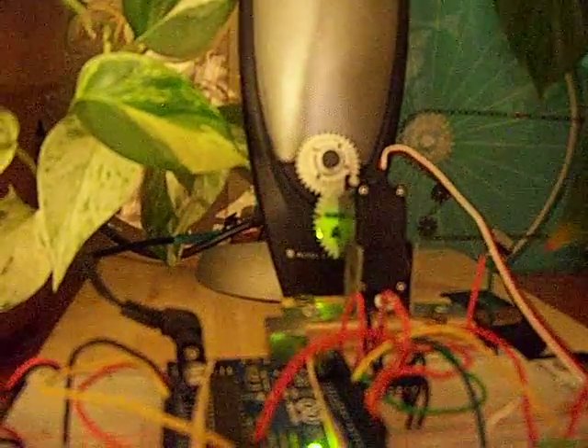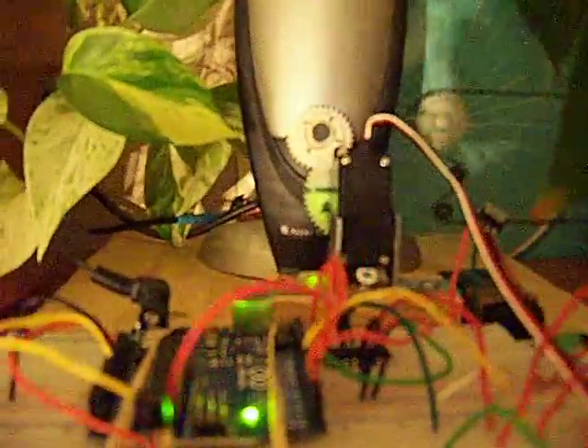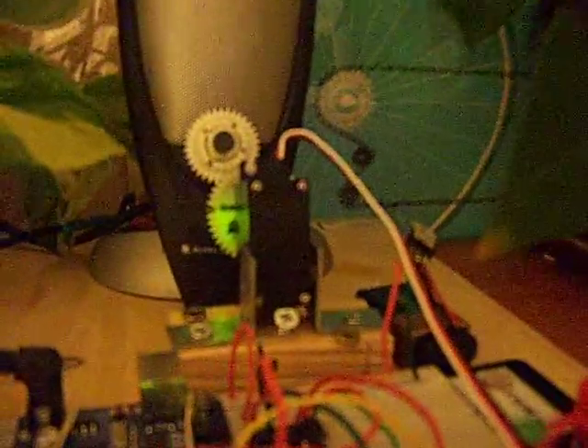I did have trouble. Once I adjusted the servo motor to the volume that I wanted, the servo motor was making a lot of chatter. I tried hooking it up to a MOSFET, but there was some bleed current and it was just chattering — I couldn't get it to stop. So I used the H-bridge that you sent me, the L293D, and I reconfigured it to run the servo motor.